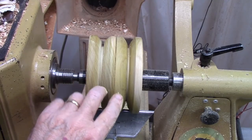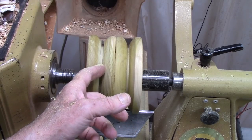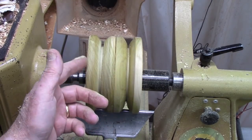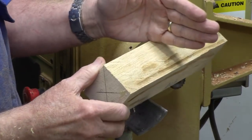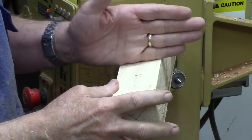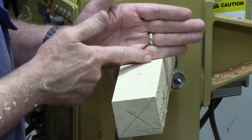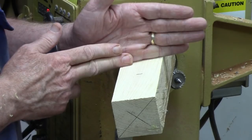Here the two pulleys are side by side and you can see they're fairly close. The critical diameter is the distance that the cord will fit, so there's some friction, and the diameter in the middle is equal on both. If they're off a little on the sides it's not going to make a difference because the cord isn't rubbing there. This piece is a little wider than 2 inches and about 10 inches long. I was originally thinking I'd round it into a cylinder and part it off, but in order to size each end to perfectly fit inside the pipes, I'd have a harder time centering the cut-off pieces. So I'm going to take it back to the bandsaw and cut it into two 5-inch pieces.